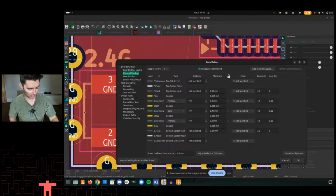Then you can also, in a lot of these board houses, so when I use something like Macrofab, you can also call out and say, hey, this is supposed to be a 50 ohm trace right here. You actually say like, this part of the board, this trace right here is 50 ohms. And in doing so, they'll go and check it for you. They'll do additional simulations. They'll check it. I don't think they guarantee it, but it's like best shot there at making things.